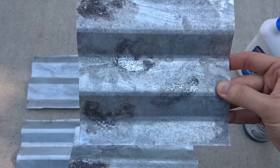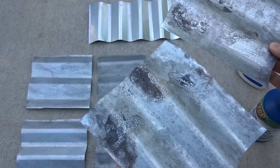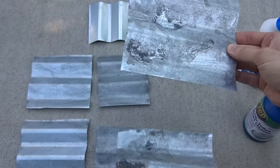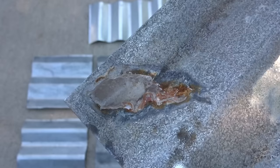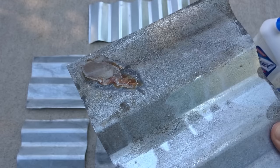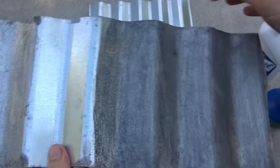Here they are with the single coat, but also with the saturated steel wool, which turned them to black spots. That's pretty cool — that's why I said you could lay them in certain areas. Mine don't really look natural, but if you were a little more deliberate about it, you could make it look really cool. It's interesting that it would just eat through the finish and turn it black like that. I also tested letting it sit overnight, and you can see how it rusted — it actually ate right through the galvanized coating to the raw metal and then turned rusty. If you let it sit soaked with rags or steel wool long enough, it will actually turn rusty and look like really, really old stuff.